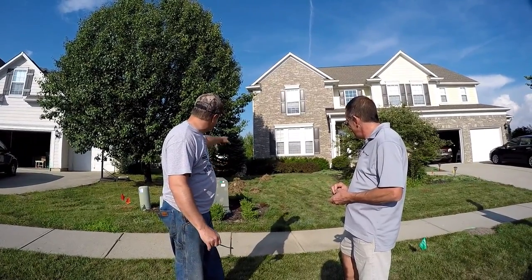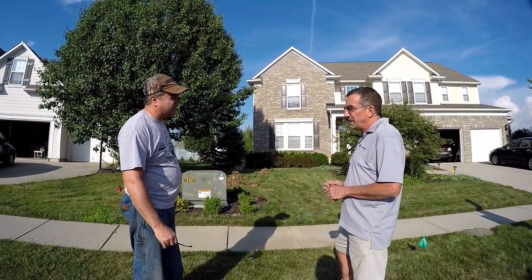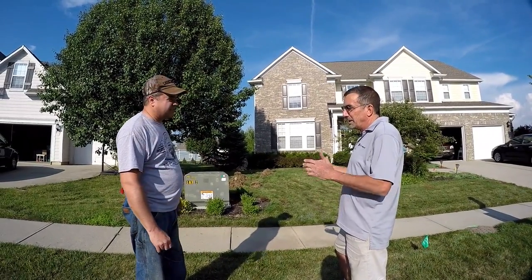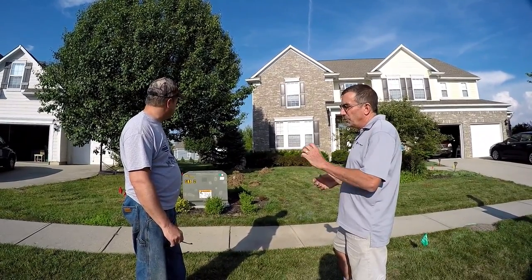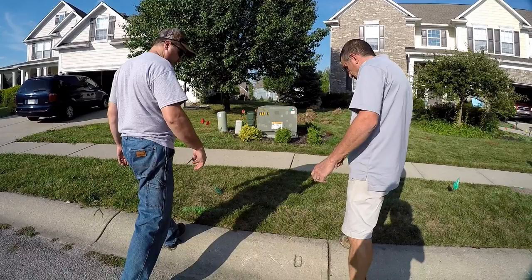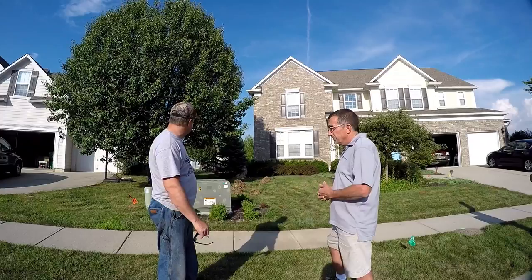You can see where there's been some groundhogs digging through there. Ward has a four-inch corrugated sump pump drain line that was put in 12 years ago when they built the house. The Bradford pear loves to send its roots over there, so it plugged up a couple years ago. He cut it open and fixed that section, but it's plugged up again. It's time to dig it up and put in two or three inch PVC. From right in front of the statue down to where the D is on the curb — the D tells you where it hooks up to the drain line for the storm sewer. Since 2008 it has to be a solid PVC line.